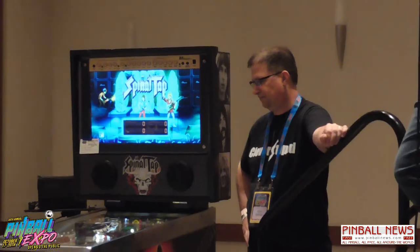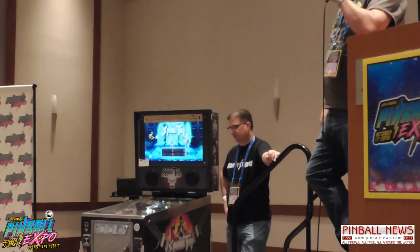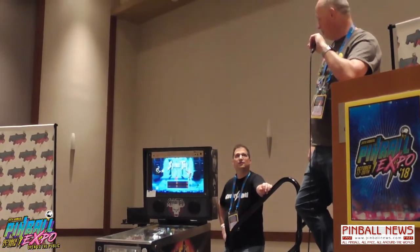We spent probably three years doing the wiring and basic setup. For those familiar with how pinball works, this one no longer has a switch matrix. It's wired more like an electromechanical — everything is grounded, there's one hot wire that goes to everything, and I've got direct leads to every single switch. We did it that way because of the non-standard programming approach I wanted to use.